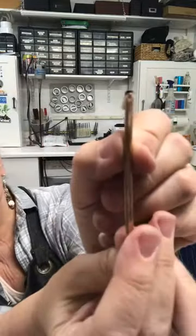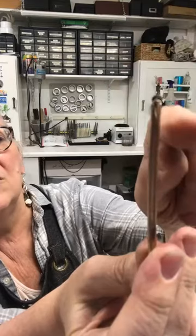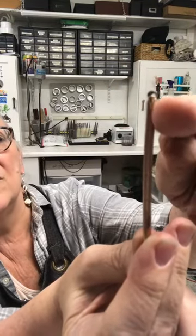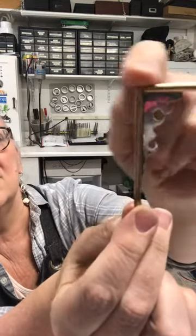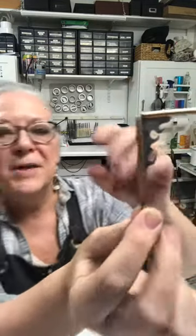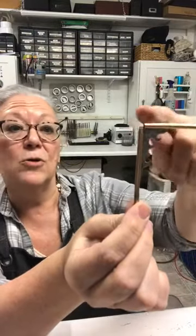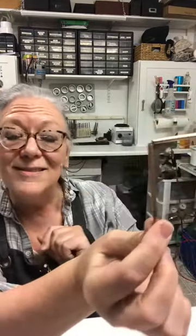You'll also notice that the mouth of the horizontal pipe goes across the mouth of the one on the bottom. So you get air coming across this way, and it blows across the smaller tube here, and it creates a Venturi effect, a negative pressure across this tube that allows you to blow your flux. And this won't clog because it's really big.